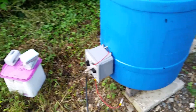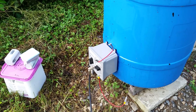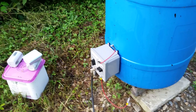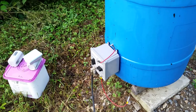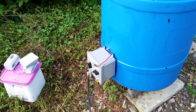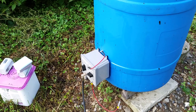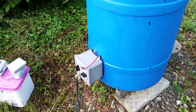Coming back here to the feed point and loading coil: first, the coax comes out from the house and goes into a matching transformer in the little gray plastic box. There are two rotary tap switches to select taps on the primary and secondary of this transformer to change the impedance step-up or step-down ratio — in my case, step-up from the coax, which is 50 ohms, to the resistive component of this antenna impedance, which on 2200 meters is well in excess of 100 ohms.